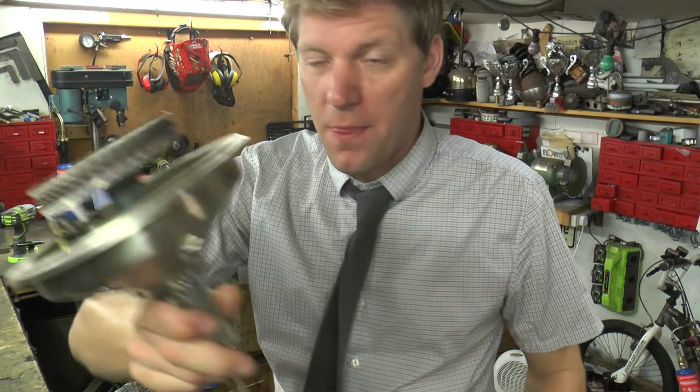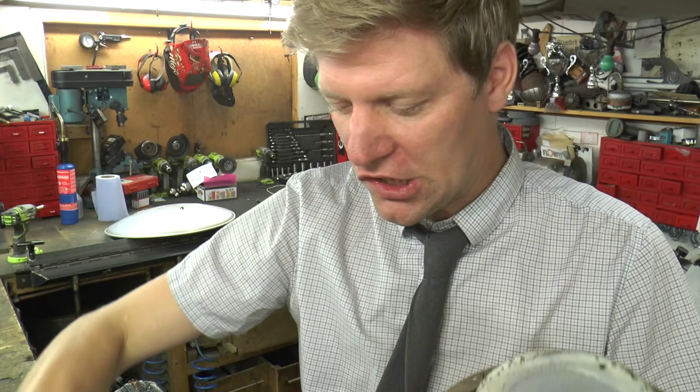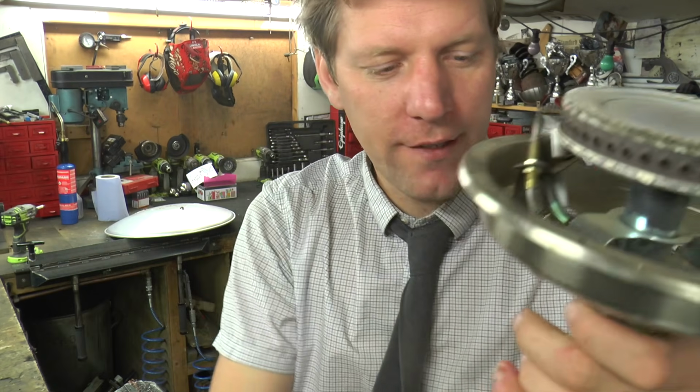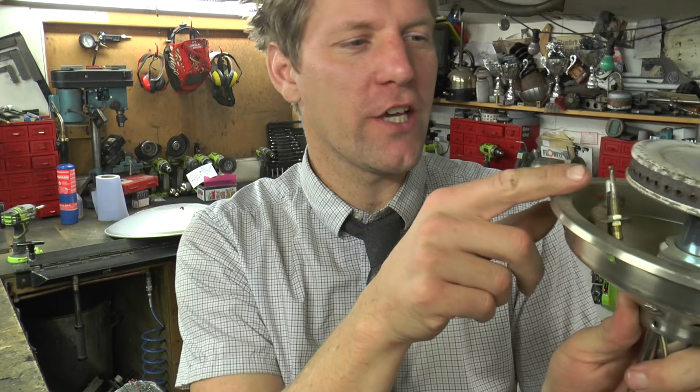Right, so this is basically the main bit we need. Now then, ideally, don't want it as big as this, because when it was a patio heater, it was actually pretty good. You could sit like 2 or 3 foot away from it, you'd still get a fair amount of heat. So, I'm going to lower that down. We're going to get rid of a load of this. We've got like thermocouples, pilot lights. We'll light it straight with a spark igniter, because that's all safety features.